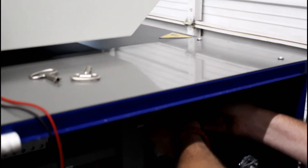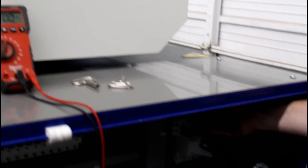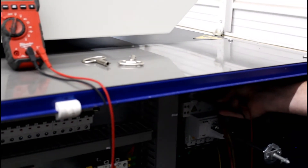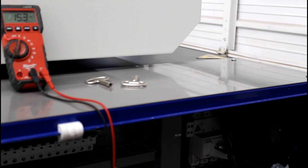We've just checked two legs. Now we're going to go to the third leg and it is reading zero volts. So now we're assured there is no power coming in to this cabinet and it's safe to work on.